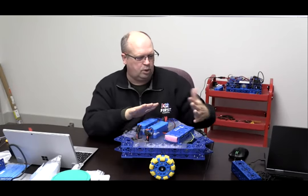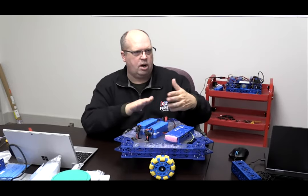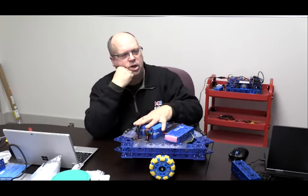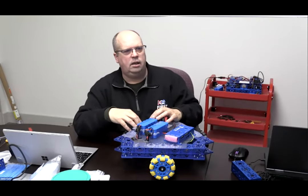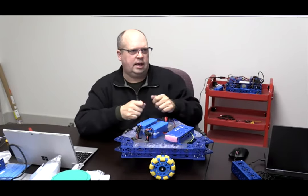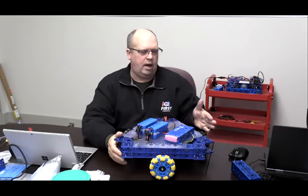So the way that we mount those electronics can be done whatever you want. You could put one on one of the plates that are there, maybe put a beam across and mount a plate on top of that, and then set everything there. If you're not sure where you're going to mount your batteries right now, because of weight distribution and how you want to work on those batteries, just put them on top of a piece of channel and use a tie strap and tie them on, right? Because then I have the ability to cut the tie straps, move the batteries around, and change those locations going forward, all right? So that'll give you a base frame.